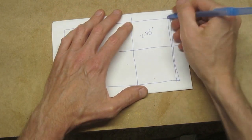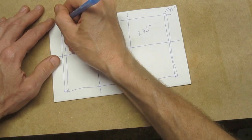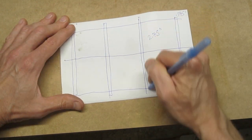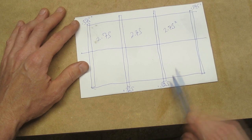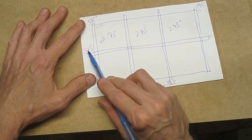Since the ends of the caddy overlap the bottom piece by 3/8 of an inch, that must also be taken into consideration. Finally, the thickness of the wood pieces comprising the bottle divider need to be factored in. The overall length of the bottom piece, then, is equal to the sum of all these sections. And the same holds true for the width.